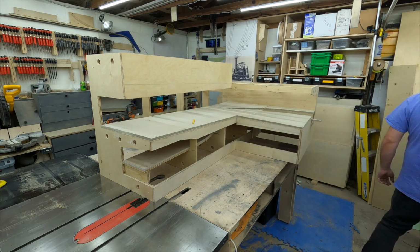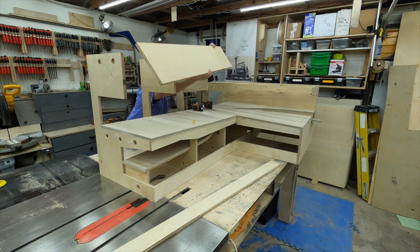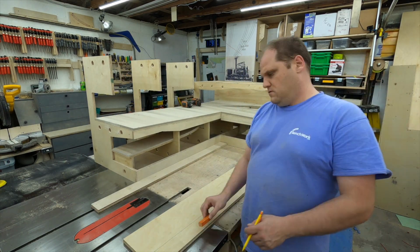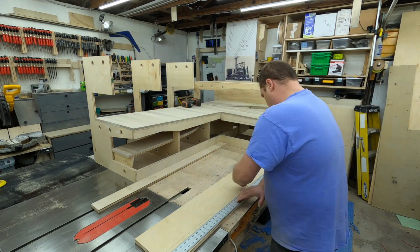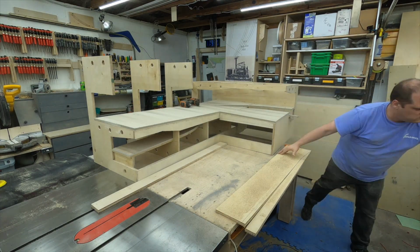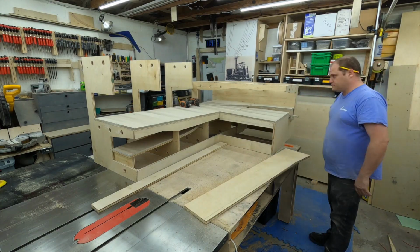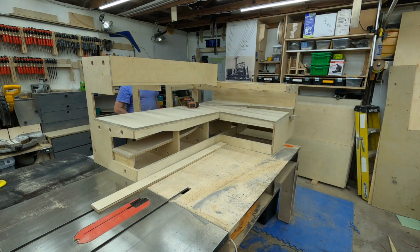And then the rest of the Homosote, I just went ahead and stapled it on. I'm using 5/8 staples, so they're only sticking into the 1/4 inch plywood about 3/16 of an inch. So it's still smooth on the bottom side, but it does fully secure the Homosote, and I can go a little nuts with the staples and make sure it's well secured.